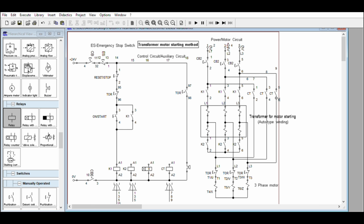We can have a voltmeter later. We will see if we can measure the voltage. Since this is a solenoid coil, there will be voltage. This is a solenoid coil, not a lamp, so that is considered inductive. So we should have voltage here. When measuring voltage, this is the line voltage, and we will measure the voltage here, the output of this tap. Of course, this is lesser than the input voltage here.